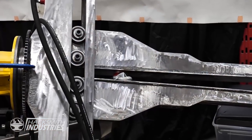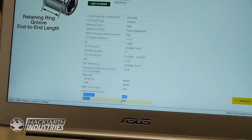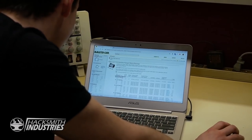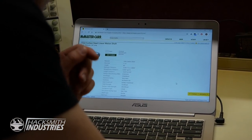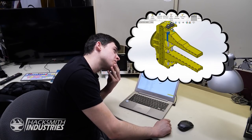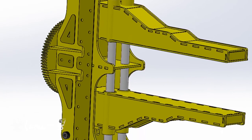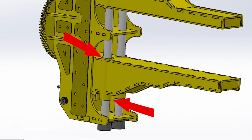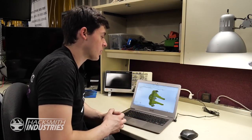Let's let Bogdan go over the new design. As you guys saw in the last episode of the Power Loader, we had some issues with the grip. So we considered multiple options — not enough force, too expensive, costs too much, too tall, too big. Only 2,900 foot-pounds? And then we came across high load oil embedded flange sleeve bearings: 14,000 pounds for $19, 1.5 inch diameter, 75,000 psi yield strength, $73. Here we have two 1.5 inch hardened steel shafts with bushings at the top and bottom of the finger, and that will allow the gripper to slide up and down smoothly. This design should be a lot more rigid than the previous one.